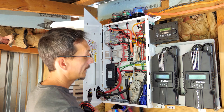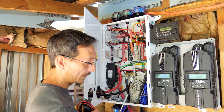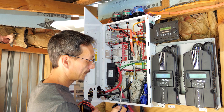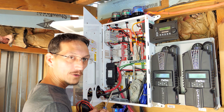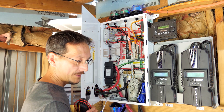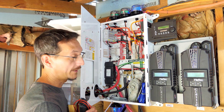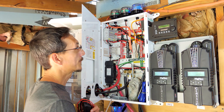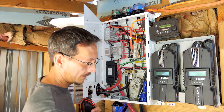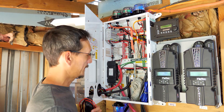If you're only pushing 120 in from your AC, then you would want to set your charger to 50%. Otherwise, it needs the 240 volts to charge your batteries. Incidentally, I just had this powered up. We ran it all day yesterday — 24 hours — and we used about 6% of our battery capacity. By 9:30 this morning it had completely recharged and we were in float. So this thing is working really well — it's doing exactly what we designed it to do. I'm going to button this up and we're going to turn everything on.